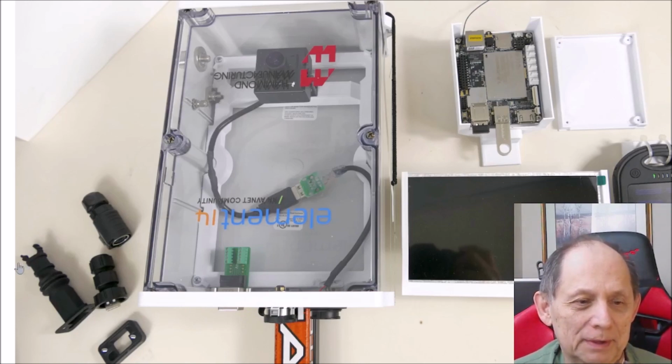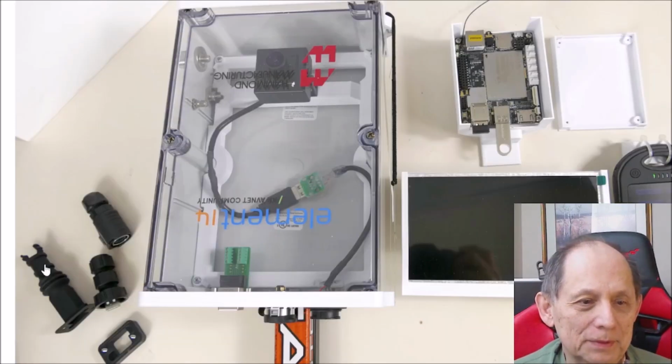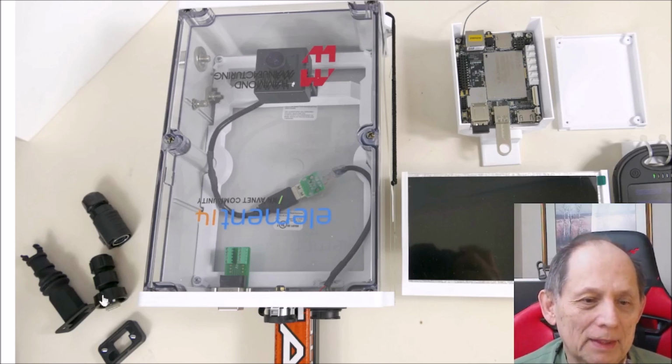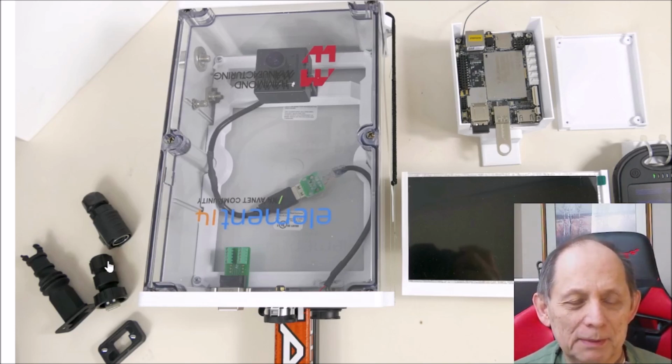And I think up here, this requires a clamp. Oops, back up. So this requires a clamp to make a seal to the cable. Down here is the USB mating connector that keeps a watertight connection to a cable. At the top of this one would be a little ferrule that is tightened down onto the cable. If you have the right cable, you'll get a watertight seal at the cable.